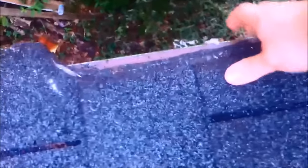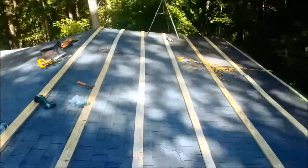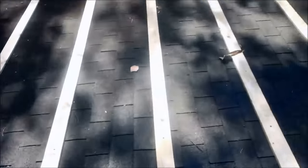That piece of metal right there is like a factory drip edge — it only overhangs about a quarter inch, which I think will be fine. The eave rake can cover that. All my wood strips are ready and down, drip edge is on. I'll cut a little patch piece right at the electrical — don't want to touch any of that. The drip edge covers the fascia, though not as much since this roof is triple-roofed. You put the drip edge on after the wood strips.